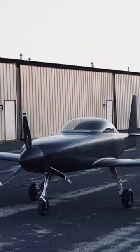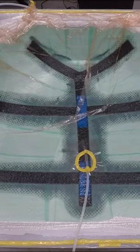We wanted to improve upon this with the Dark Arrow 1. We wanted to be able to go directly to paint with our airframe structures, and I think we're most of the way there. The way we're doing that is we've gone through a lot of effort to make precision molded components. We've molded all our airframe structures from molds made through a CNC process, and then used an infusion process to mold the components, which basically eliminates any pinholes or voids that you might see in the structure.